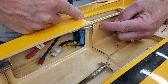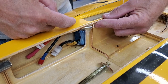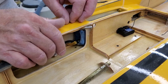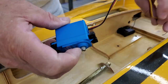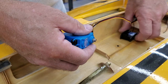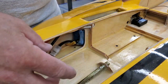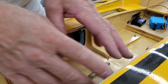I've added a hole right here — this is where the old switch used to be when I used switches — and I just enlarged that hole so the end of the extension can come out and connect here, then connect back here. I hate using extensions; I like wires to be as short as humanly possible. I just can't come up with another solution for this. I don't want to move battery and receiver to the rear — I think it'll still be in the way if positioned back there somewhere. I just need all of this free access area here to get batteries in and out quickly.